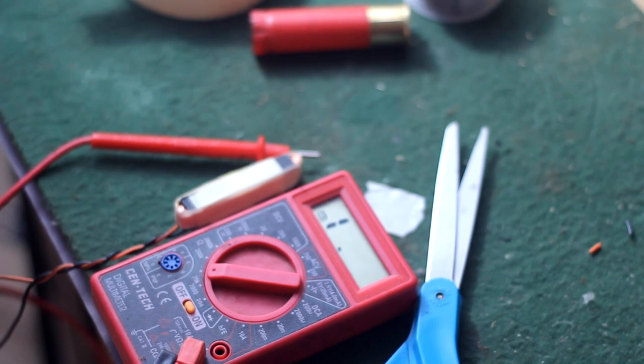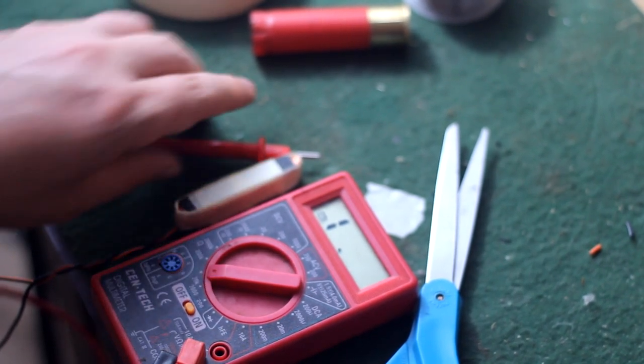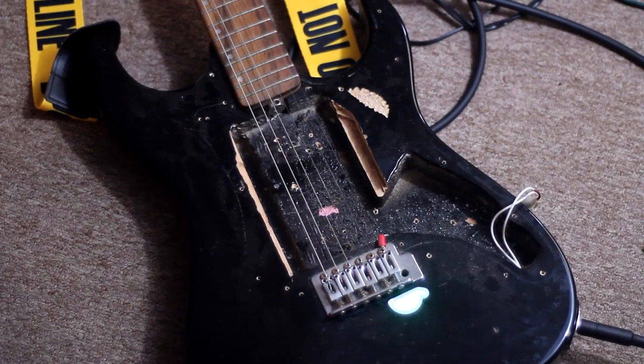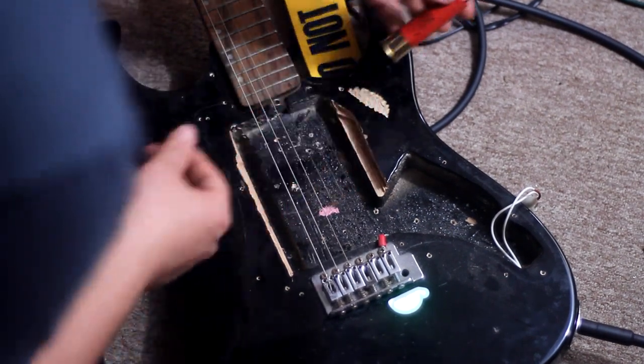Okay, so here's supposed to be the video of me testing the resistance of the pickup, but the video's gone. There's the one before it and the one after it. So please excuse the continuity error here and the bad lighting. I went and grabbed the camera out of the bag, turned it on. Battery was about dead. I took the meter, hooked it up to the guitar really quick. There you go. 2.1, 2.09 technically, but hey, I guess 2.3, that's pretty damn good.